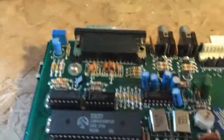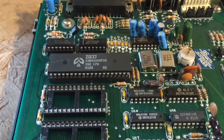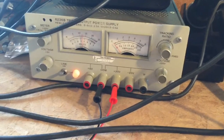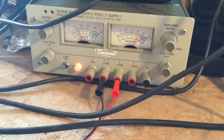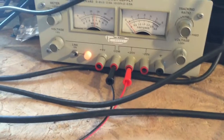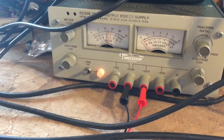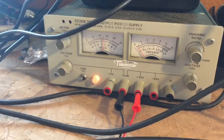I've reintroduced these two small logic chips and powered on — no effect whatsoever. But reintroducing the Z80 processor, watch the power supply as I turn the unit on: the current jumps up and the power supply goes into current limiting mode. This power supply is only capable of half an amp, so it's possible the unit simply draws more than that. But I do have a spare Z80, and I'm going to try that.